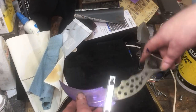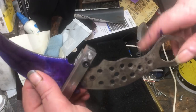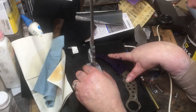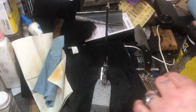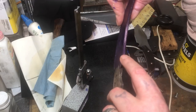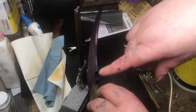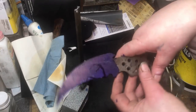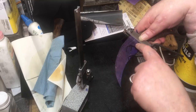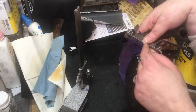I have to take this off to do the center line — can't really get it flat there. I think I'll do some of the bevel and then we'll surface grind this. I want to flatten everything out. I'm going to start out like that — not going to take it right to the thin point, but as we go up in grits I'm going to make it thinner and thinner. For the 36 grit we're going to start there. I'm going to stop about halfway up with this on, so I can put the belt right on the edge and cut straight up, then take it off and use the J-belts to get it all smoothed in.